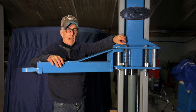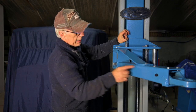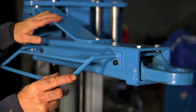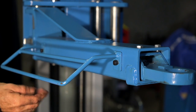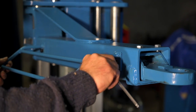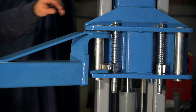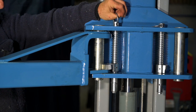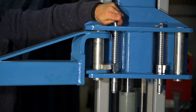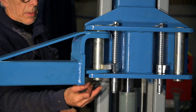When you install the arm, make sure that there are no bolts on this side — all the bolts should be on this side, where the black bolts are and where you connect the protection shield. With the arm in place, install the protection shield so you can't put your feet under there — this is a safety feature. If you need to swing the arm in and out, pull on this ring to unlock it, then turn it, and let go again to have it back in place. Don't forget to put the circlip at the bottom of the rod.